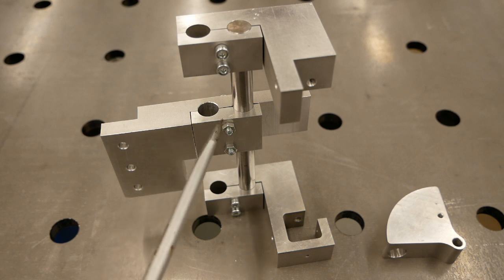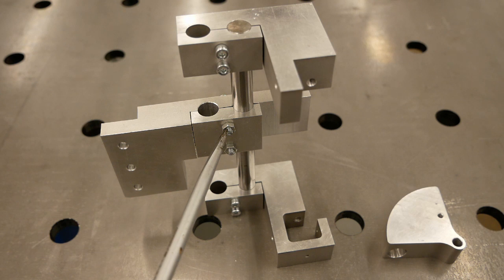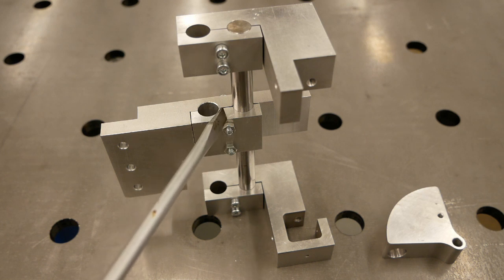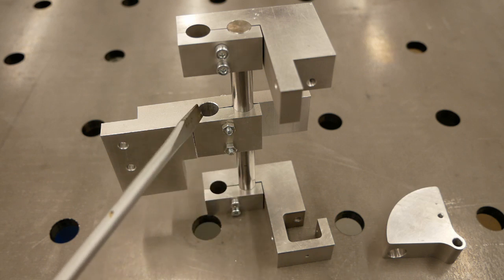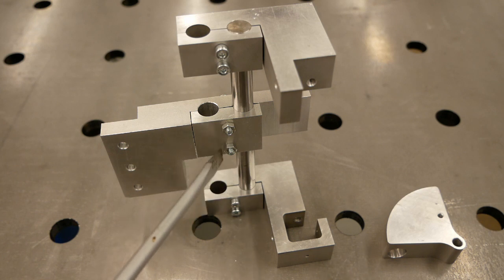When I put the simple mock-up together, I noticed I made a mistake. It's a small one, but I need to remake this part. As you can see, these M4 bolts go straight through the part and I needed nuts — that should not have happened. There should be M4 thread in this part, which I forgot. I just drilled it 4mm, so the model is correct — it was just a fabrication error. Otherwise it's going to get really tedious if you open and close the clamps and have to hold the nuts every time, so that's not really an option.